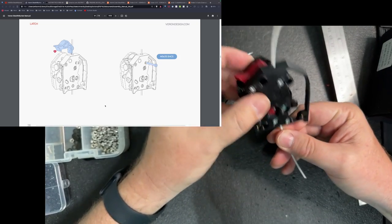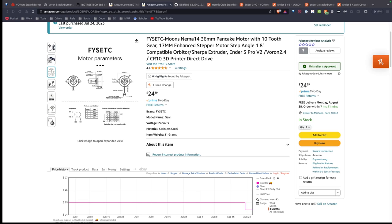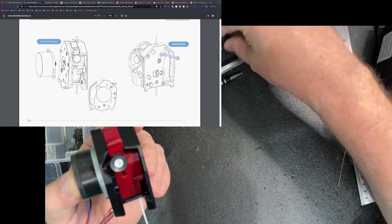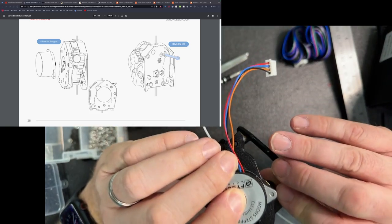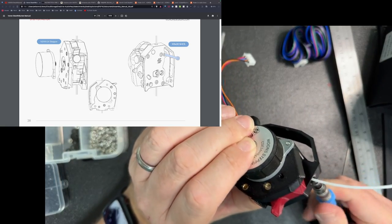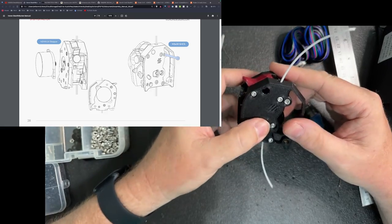It still feels like we're grabbing the gears and grabbing the filament — there's some tension there. That's looking good. So for the next step, I need my NEMA 14 motor. I have that and I'm going to go ahead and install it now. I'm going to orient the motor this way and then I need to take an M3x30. Let me see if I can go through the right hole — I think I need to go through this one. That's going to grab this hole right here, and then the other screw is on the inside.